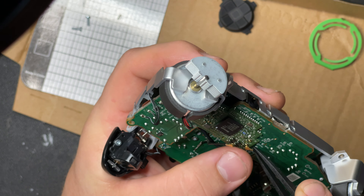These wires do tuck into these little cavities right here. Now we're going to apply these - take the sticker off. I'll share a little tip: to get these to line up I actually use tweezers because this little ribbon is too long and wants to push farther out than it should be. Basically you're just following the curve of this open circle where the metal is, getting it lined up as best you can. It does not need to be perfect, but do the best you can - I'll show you why in a second.